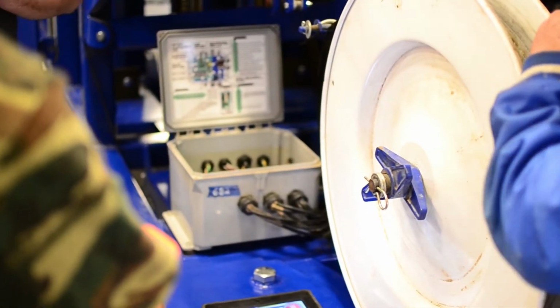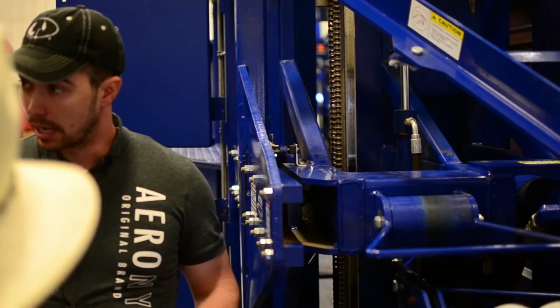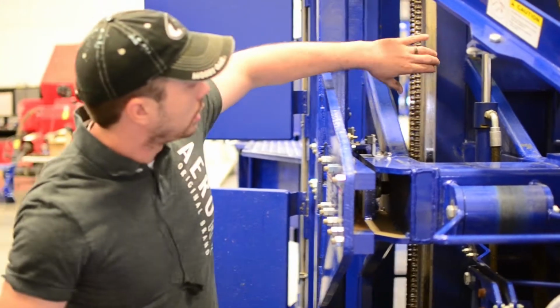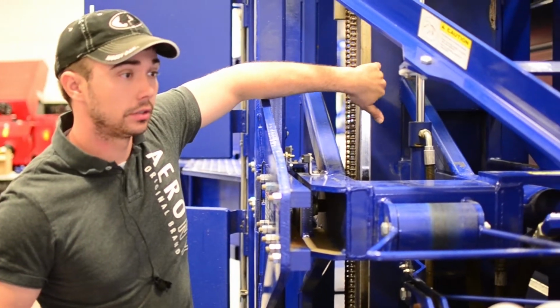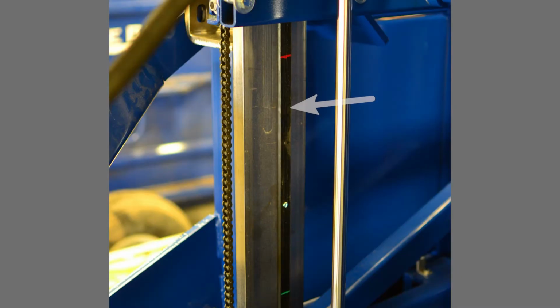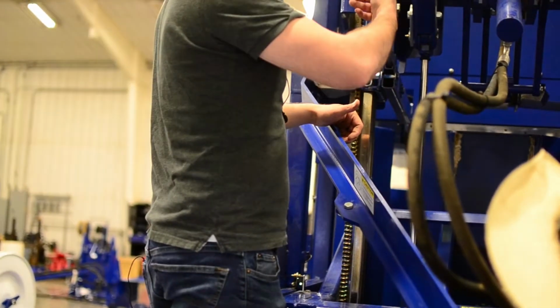But I don't know if it's reading. So that's where I need to look at my inputs. Now my inputs, the trap guard arms read several different inputs, okay? And so inside this chrome rail here, you see the black strip? It's only on this side. There's a little bolt here holding it in. See that black strip right there? And then also, do you see the colored lines on it? You got a green one here, you got a red one here, you have a white one clear at the top. All of those are matched with the colored wires that are actually in that.